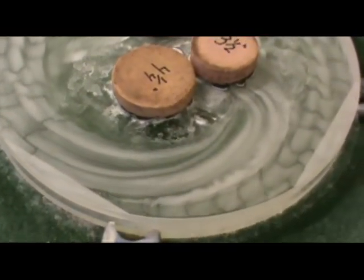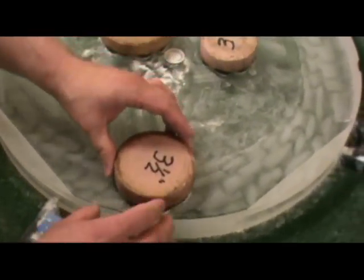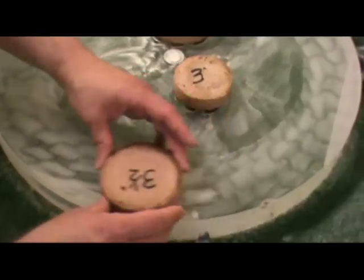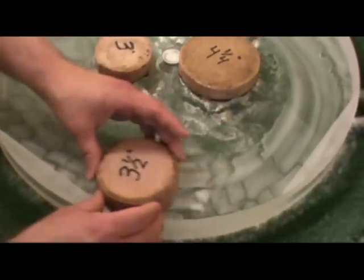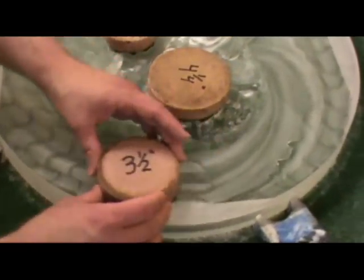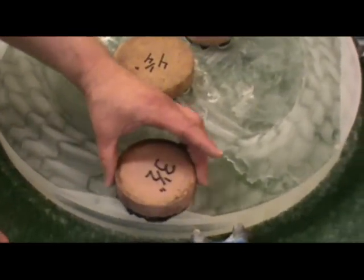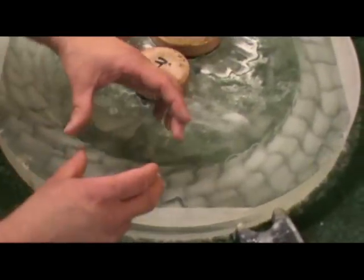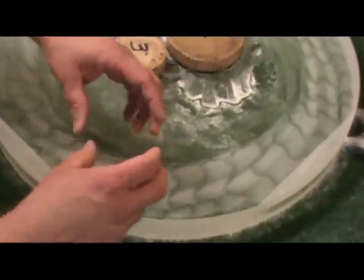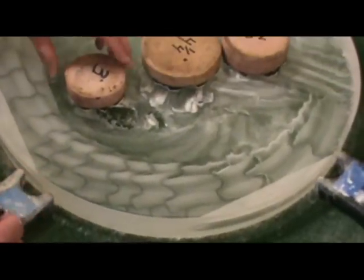The next technique: when you're doing repetitive work on one narrow small zone, it's common to use straight strokes, called tangential strokes, where you're just moving in a straight line back and forth. But if you do this over and over again, you're going to leave some patterning and, worst of all, roughen up the tool. Anytime you start, stop, or change direction on the tool, the point where you reversed gets a little rougher because that's an abrupt change of direction — you get a discontinuity there with the pressure. So one technique to eliminate that is to use a long elliptical stroke instead.